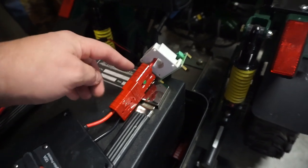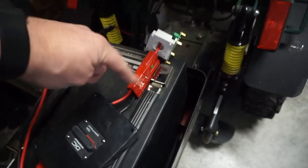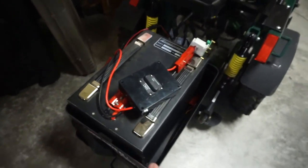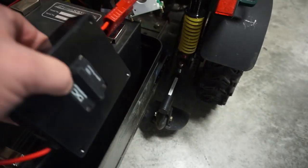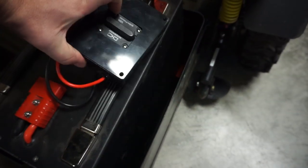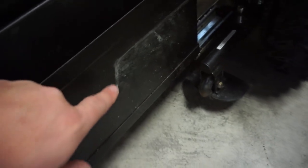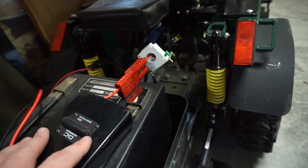What I'm going to do is get another set of Anderson connectors and wire up a short pigtail that I can plug in line with all this. I'm going to mount this thing inside of a box, get it sealed up good. The data logger cables are not very long, so I'm going to have to extend those cables as well. Right now this just kind of slides down in here and flexes the side of the box. You can see there's scrape marks on the side of this box from this being slid in and out.